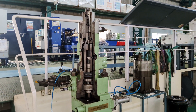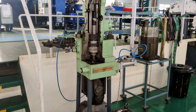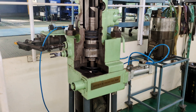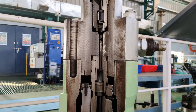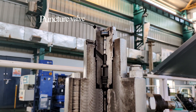This is the cut cross section of a fuel pump of a MAN B&W MC engine. You can see the different parts: we have the cam follower and the roller guide below. You can also see the VIT actuator and the rack. Here we have the fuel pump plunger barrel, and on top we have the puncture valve assembly.